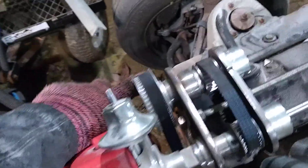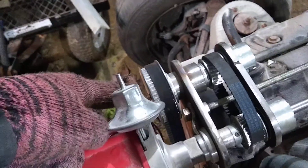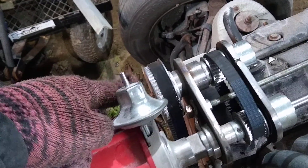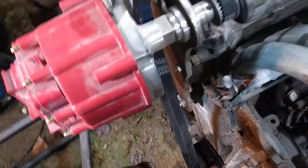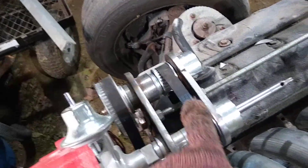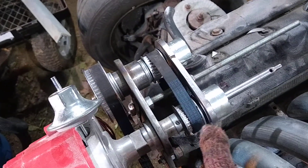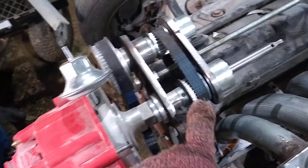The way it works: it comes up to this intermediate shaft, and this is where the speed reduction happens between the crank and here. That's a 25-tooth sprocket on the crank side, this is a 50-tooth, and then these are two 25-tooth sprockets. It just spins the distributor. I've got this pinned through, with a little bit of bracing here — this is just mocked up at the moment.